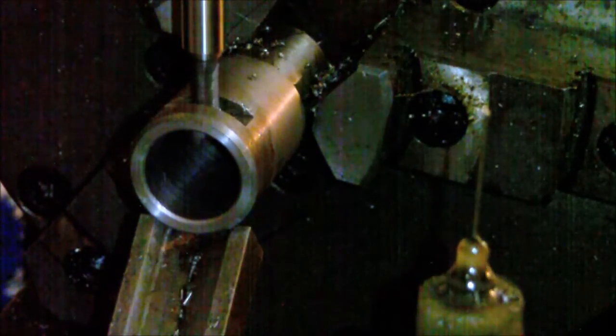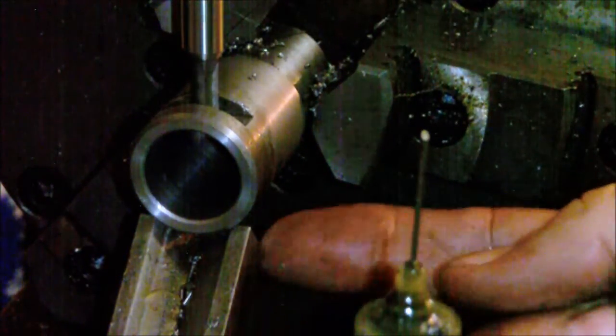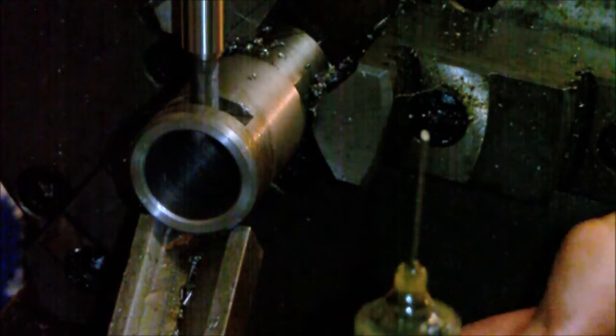Okay, so now we're through, and I'm going to start rotating to do the cut sideways, which hopefully will hold it stable enough. I've got this piece here. It's basically a cheater jack. It's a V-block clamped in my vise and my mill.